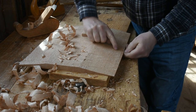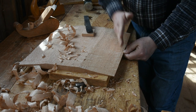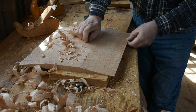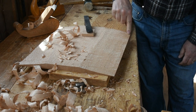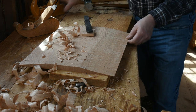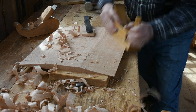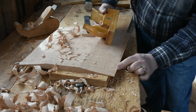You might wonder — half an inch of this is going to go in the frame of the chair — why I'm planing way over to here. But that's to get a long sloping bevel, not a steep one. I'm a little bit thick at this bottom end of the panel and a little thin right there. So now I'm going to switch to a smooth plane, being aware that I don't really want to hit beyond here.